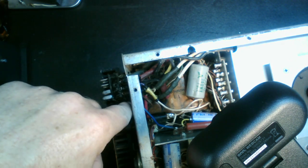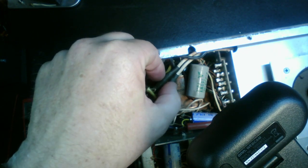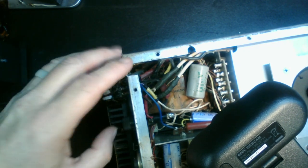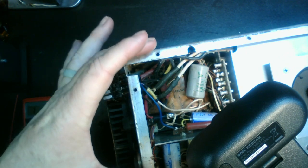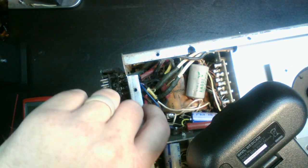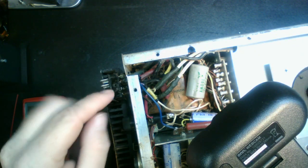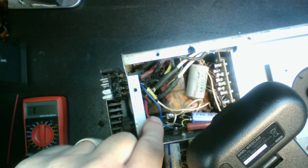There are a lot of wires in the way. One leg is soldered to the chassis, so I'll probably get the fuse holder out of here. I'm going to undo these two wires anyway to switch them around on the connector. I might have to pull this blue wire off where it's soldered. I think I'm going to be half-removing this just to get into those capacitors easily — I don't want to damage anything else. I'm going to have to do some soldering, and it's going to have to be hot soldering especially on the ground side of those capacitors since that goes to the chassis. So I'll get the fuse holder out to get to those capacitors.